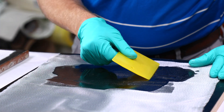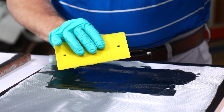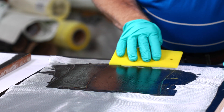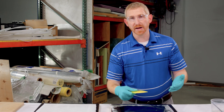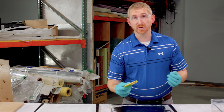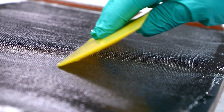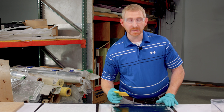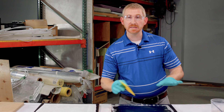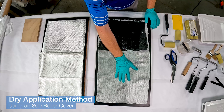As you run the spreader over the surface to fully wet out the glass, you're looking for white spots — an indication that the glass isn't fully saturated. As you work the epoxy across the surface you don't want to overwork it. The more you work it, the more air you entrain, and the epoxy will turn cloudy from micro-bubbles and trapped air, which is very difficult to remove. Lightly work it all the way to the edges and pull on the outside edge of the glass so it lays flat with no wrinkles. Then let the epoxy get tacky — similar to masking tape — then wait a few hours to recoat.